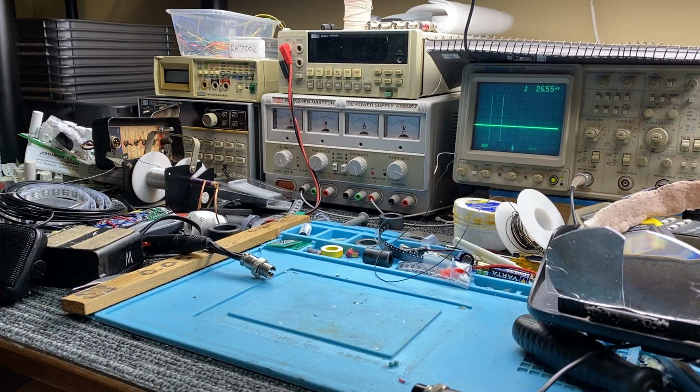I have fixed so much industrial equipment over the years where the manufacturers and some of the big names who should have known better decided to put acetic-based glues and adhesives on their circuit boards, and it'd go dead. You just look for where the glue was, and you chip away the glue if it's gone hard, or remove it, and lo and behold, there's a track eaten in half. Very common. So a lot of things have been turfed in the bin. I was repairing $5,000 and $6,000 and $7,000 circuit boards because of that, and all it was was tracks eaten away. So very easy fix.